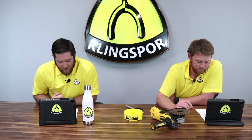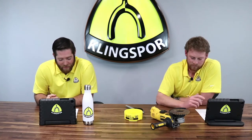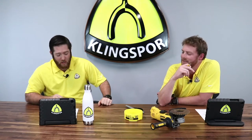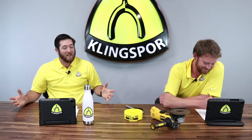DT Mike and the boys ask: we're big fans of your flap discs, but our people are only using a small section of the disc before throwing them away. Would CMTs be a good alternative? From a savings standpoint, the cheaper disc would be better to use in a situation like that. The easiest fix would also be adjusting how they're using the discs — we do have videos showing proper usage. But yes, a lower-cost disc like a CMT would help reduce waste costs.